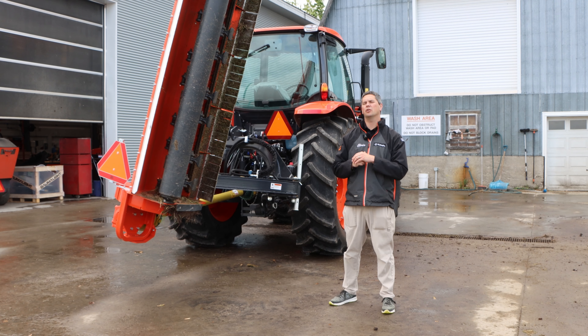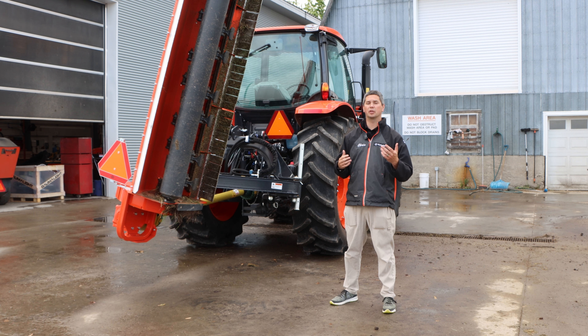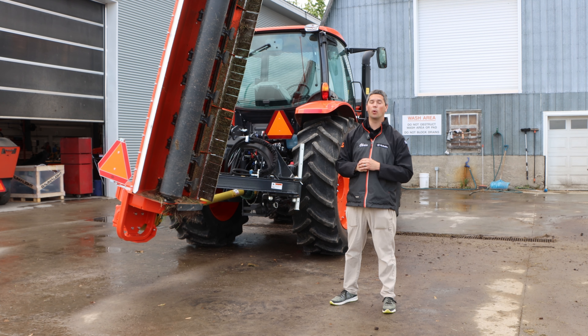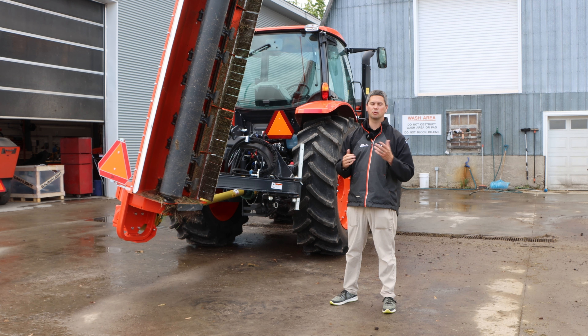That brings us to the end of today's video. I hope you enjoyed learning a little bit about the chopper as well as some footage of it in action — it's always exciting to bring that to you with the GoPro, seeing the grass flying at you. Pretty awesome units. One thing I should point out is Kubota's marketing will show that chopper up on its end cutting back tree branches and stuff — it doesn't really work that well. So just be mindful: if you're thinking you can trim your trees back with it, it doesn't actually work well because the branches fold out of the way and then pop back out. It's mainly used on the ground, and it does a wonderful job at that — again, up to a two-inch capacity depending on what blades you have.